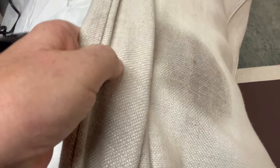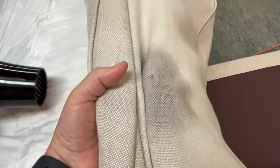In my steam cleaning truck mount days, I'd get a call the next day, something returned or a spot returned. I'd go out with a little bit of citric acid or white distilled vinegar and put it in a bottle and just mist the area and it instantly disappears. The browning gets neutralized. Basically, what you're doing is you're neutralizing the pH scale.